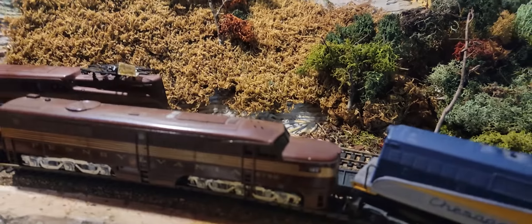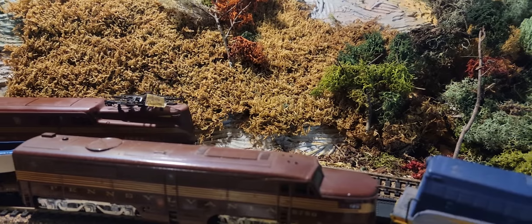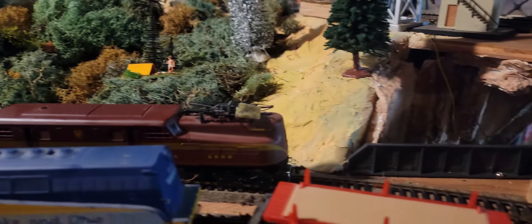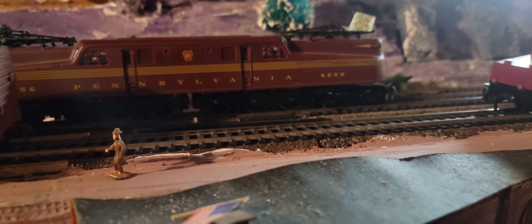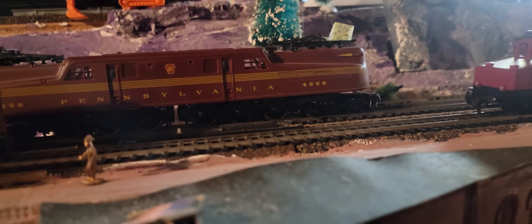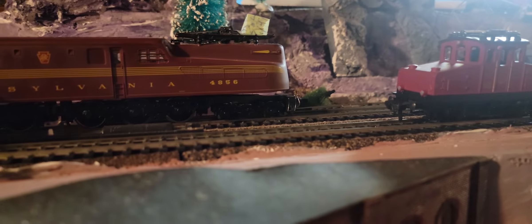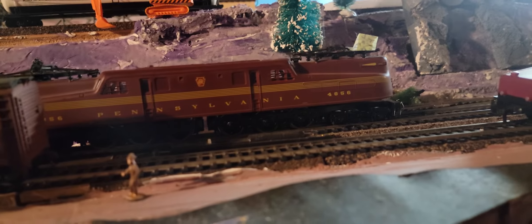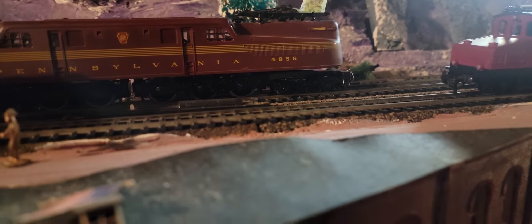As you can see, it started. Like all GG1s, it has 12 wheels that are supposed to be powered, and in this version they are powered. It has a leading truck and a trailing truck, so it has a grand total — the reason why it's a GG is that there are four leading wheels that are not powered and then six wheels that are powered. In the Pennsylvania Railroad, the steam engine that was a 4-6-0 — just like the front half of this is a 4-6-0 — it's called a G. So they just became a GG, and it was the first, so it became the GG1. But as an electric, they count axles instead of wheels, so it's a 2CC2.